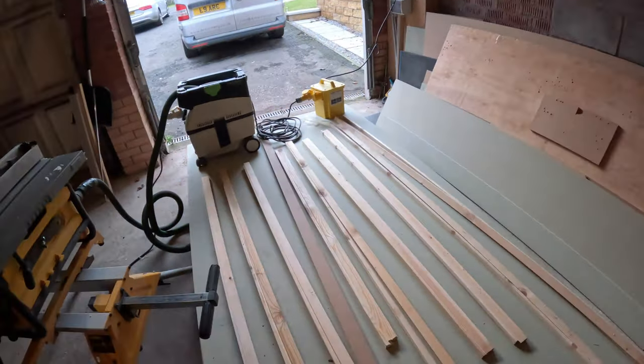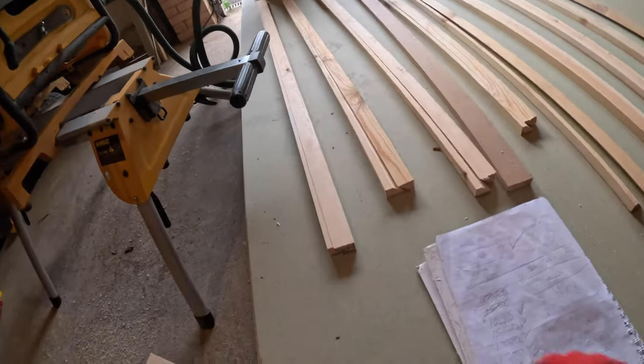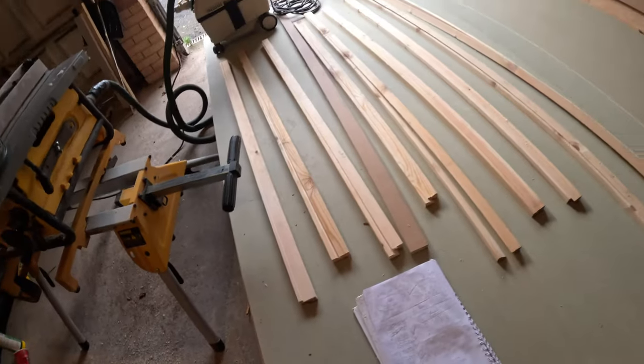That's all the cleats ripped up. So basically what I've got is I've ripped up 45 degree angle through each and every one of these and they will basically slot in with each other and that will pull the cover tight to the wall. So catch us back at Bearsden once we're done and ready to get the rad covers installed.